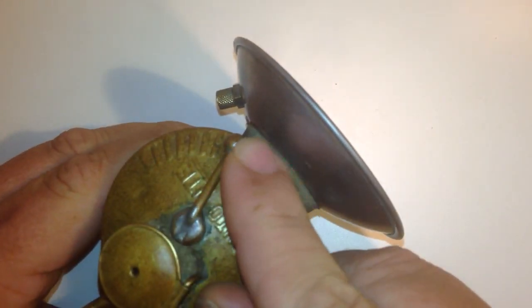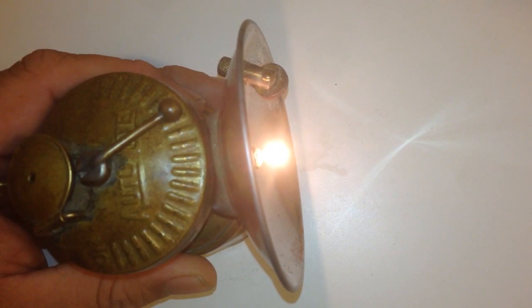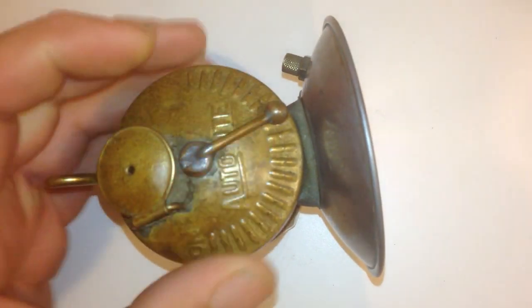Let's give a little assistance because it's a little awkward to relight right there — but there we go. Our gas is being produced by that chemical reaction in the base: the water and the calcium carbide. As it starts generating pressure, it's forced up past that felt and out through this little jet, producing a really nice bright white light. I can throttle it down a little by adjusting this. It takes a couple of minutes to really stabilize, and as that gas production is settling and building up inside the bottom, it does put off some heat — this bottom can get pretty warm to the touch.